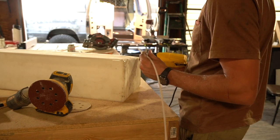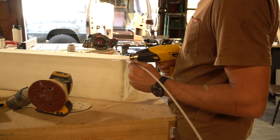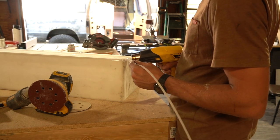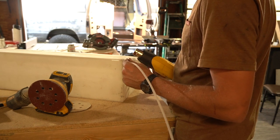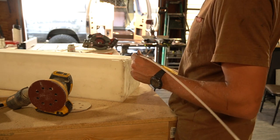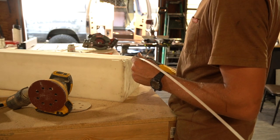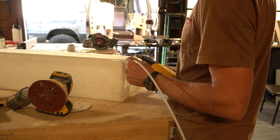I'm going to practice this whole side. My goal is to plastic weld it like this, then epoxy over the top of it, and also take some flex seal and pour it on the inside and slosh it around, so it's like a new seal. And again, we're not drinking out of this — this is just a holding tank. Ideally I don't want it to leak.